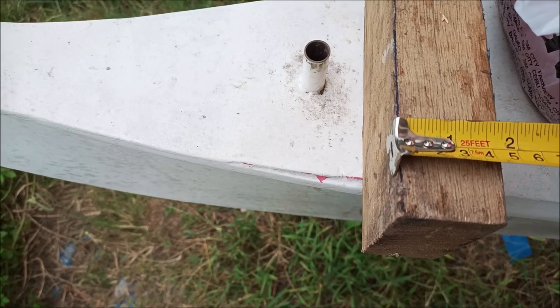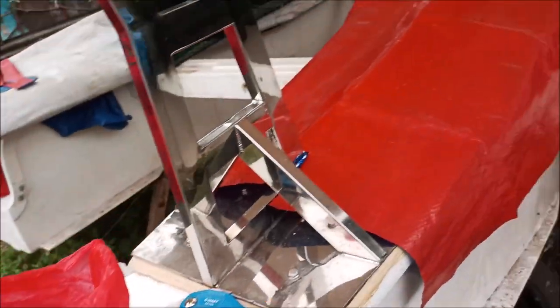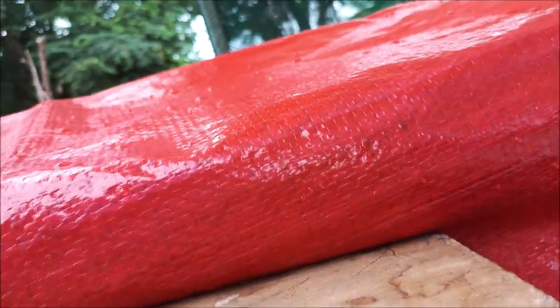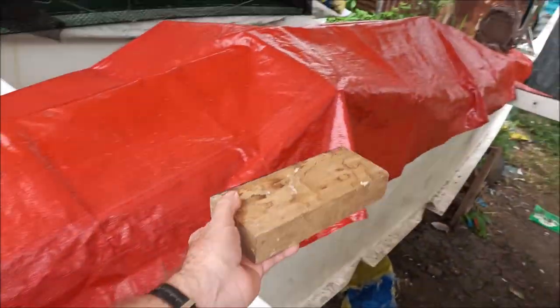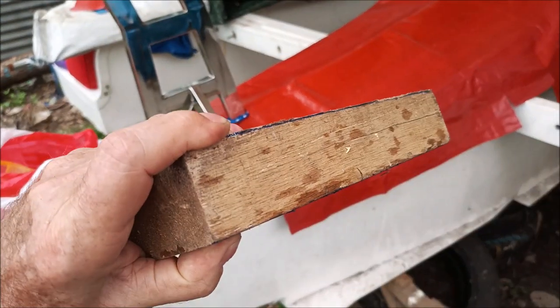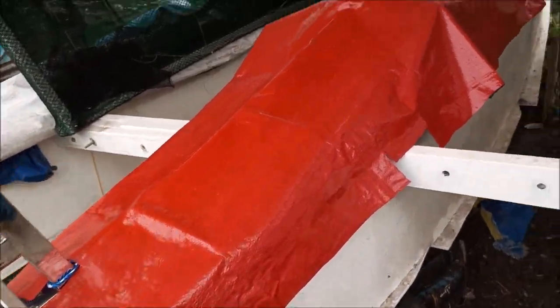The two-by-four is actually one and three-fourths inches. What we're doing is putting it under this lip — you see this lip here — we put it under there and mark on the tarpaulin, then move it and mark it again. We're sliding this as a thickness gauge all the way down this side. Since it's one and three-fourths and we may want two or two and a half inches, I'll just drop down another three-fourths of an inch and cut from there so I've got a reference line and I'm not just eyeballing it.